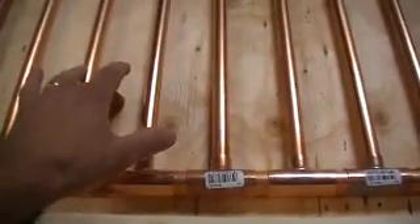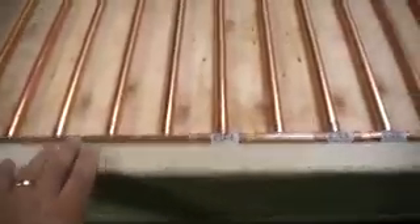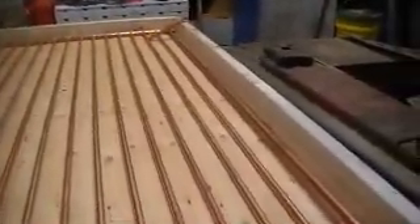By doing it this way, it's a regular four-by-eight sheet of plywood, three two-by-fours — two up the sides and one cut in half and trimmed for the two ends. The pipes in between the tees are two inches, so two inches between each one. That's what gave me the very close fit here, which worked out very well. I have one of these in between each of these tees all the way across, top and bottom, and that gives me the 16 riser tubes.